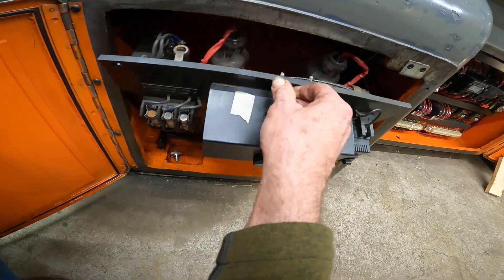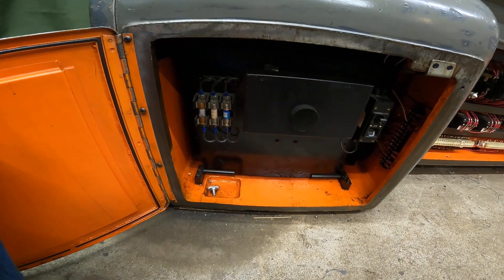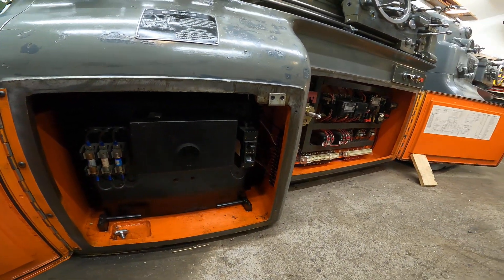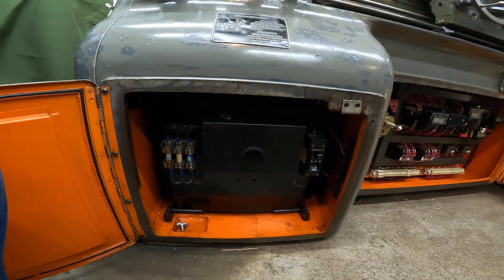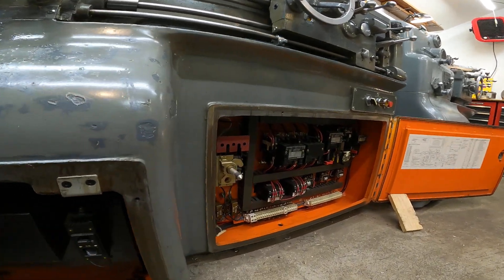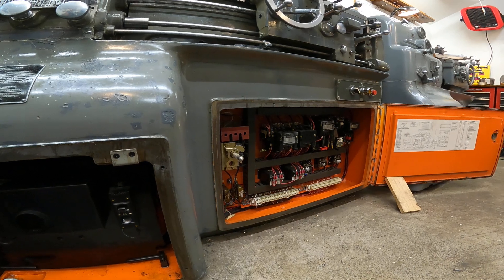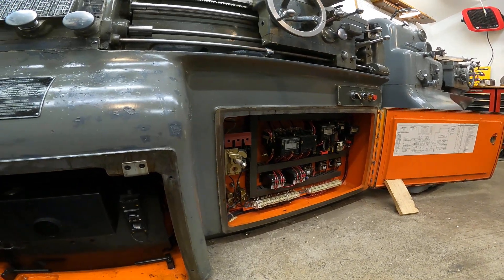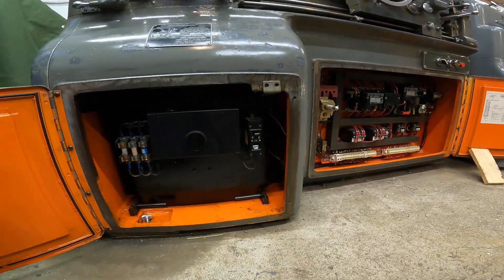Often you'll find that these machines have been altered, and you'll have to decide what you're going to do about the drive situation if you purchase one. These things might seem complicated, but after a few years of owning one you become quite familiar with them. If I found one with this stuff stripped out, it wouldn't be a problem for me to restore it — but that might be a tall order for someone just starting out. If I found a good machine with a Mickey Mouse drive in it, I'd bring it back to this. Or there's the option of spending the money for the modern one from Monarch — their AC inverter, seven-and-a-half horsepower drive. I had an opportunity to try one and it works great.